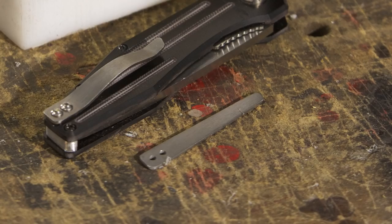So they're milled out into little flat blanks. The first couple of prototypes that I made of this little part were bent with a hammer — that is not a long-term solution. My whole theory of these knives is that I want to be able to batch the components — do a whole bunch at a time — but not in such huge numbers that if I want to tinker with the design I waste tons of parts. I also don't want to do them in onesie-twosies because that's totally inefficient. I need a way to efficiently bend these little guys into shape, with predictably formed parts every time. Quality is job one, efficiency is the second goal, and flexibility is the third.